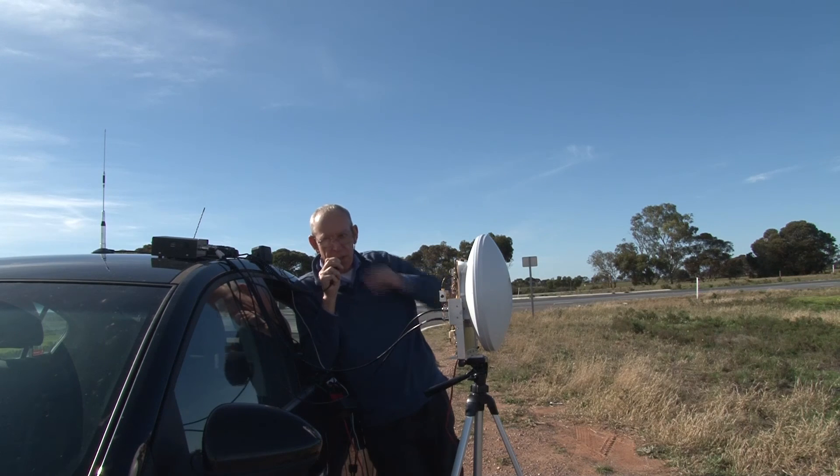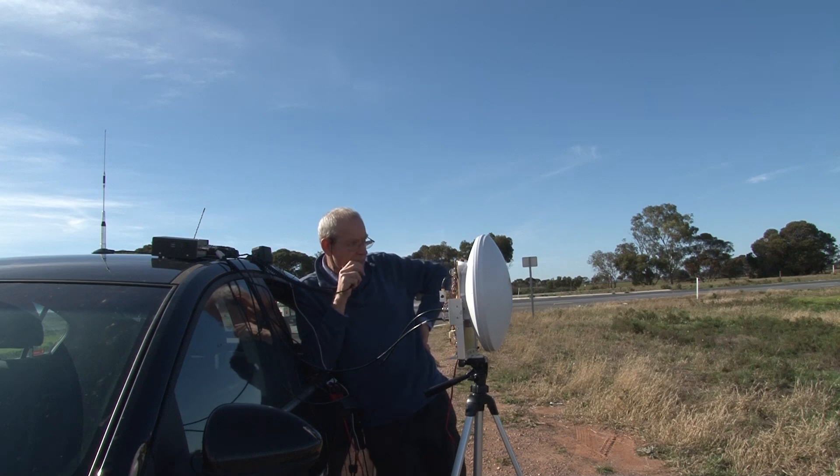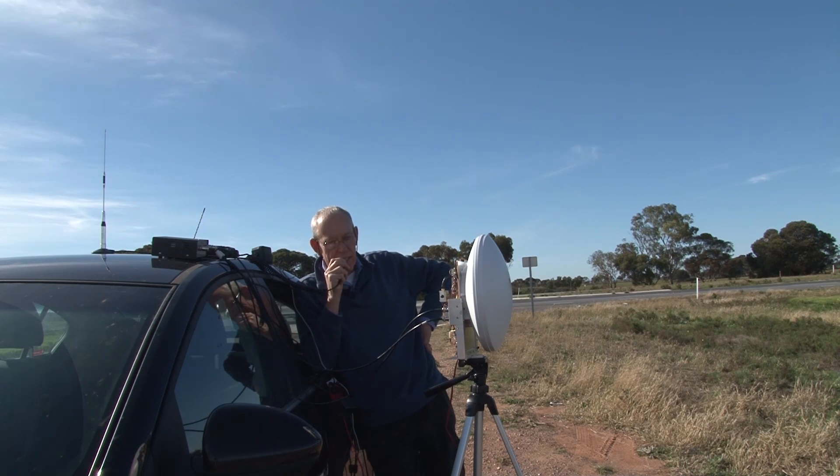The other thing is, when you key your transmitter up, I can hear something before your sequencing finishes. I'm not sure what the order of events is, but I can hear something coming out of you before the sequence has finished doing all its switching, and then it jumps to being fairly strong over. What that would be is the amplifier switched on last — the relay being positioned, and then the last thing is the amplifier. So there's probably a bit of bleed through through the amplifier there. Did not hear it that time. Whatever it is, it's definitely not very much.